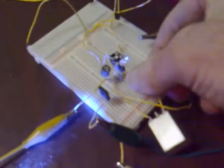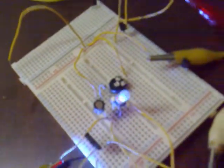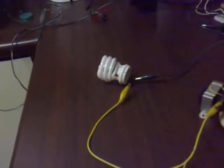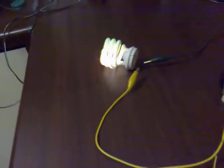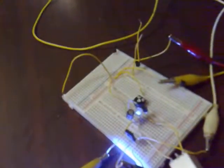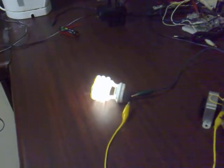The current draw is 129 milliamps. If I pull the relay coil out, the bulb continues to flash and is strobing. That little LED is strobing as well. But if I remove the LED which was across the relay coil, the oscillations die. So I'll put that back in — LED back in, relay coil back in. When I remove that LED and relay coil, the current draw goes up to 300 milliamps, as opposed to 130 milliamps in this configuration.